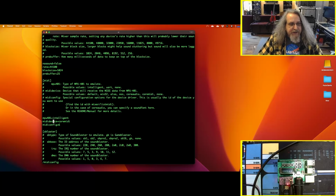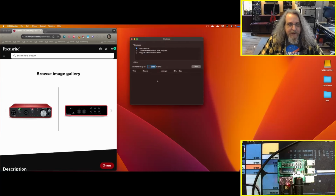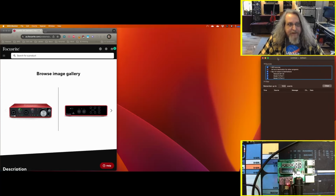So in the DOSBox configuration, look for MIDI config. You need to change, well, I don't know if you do, the default might work, the MIDI device. I change it to Core MIDI because we're on macOS and that's what it is. And I set MIDI config to 6, which appears to be that device ID. So we'll go back here and fire up the MIDI Monitor. One of the nice parts is we can spy on the output, both in and out coming to that device. So I'm going to say spy on that across everything. I'll bring that over here